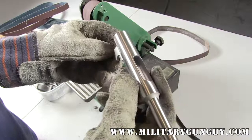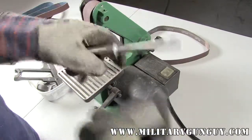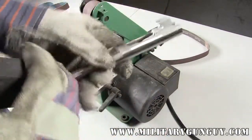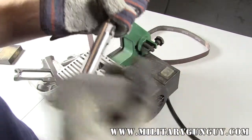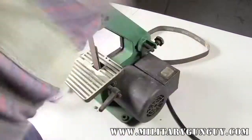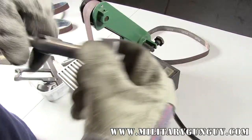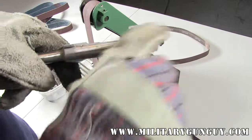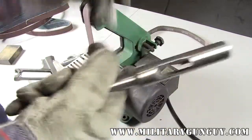This is probably about as high a polish as we're going to get with the belt sander. What I'm going to do is move everything into the vise and show you how to blend using a sanding block. You start blending the areas between the parts polished by the belt sander and the parts that are still rough from the bead blasting. I'll just clamp it in and show you — it's probably easier that way.